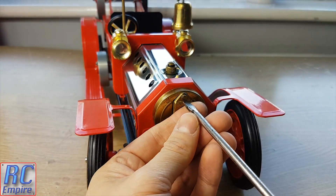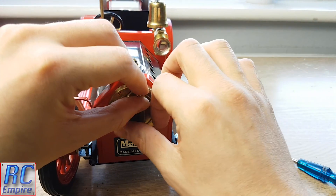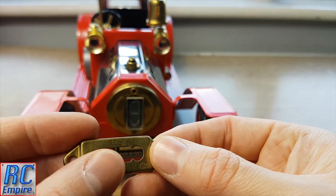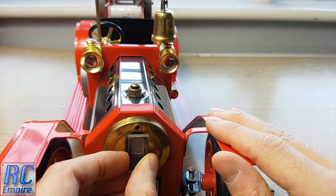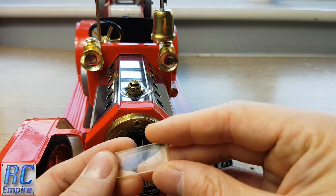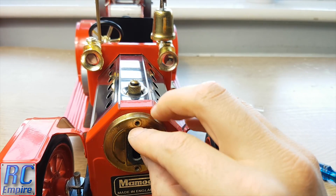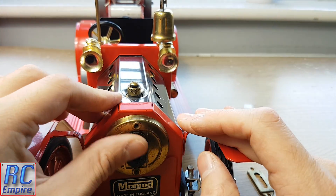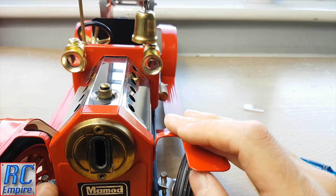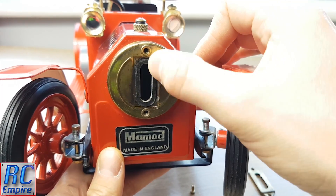To replace the glass, you first want to remove this cover. You can see that this is just a simple thin metal brass cap which holds the glass in place and presses it onto the rubber. With a little wiggle, you can pull the old glass off — do be careful just in case the glass is smashed and you could have little splinters. You can just see the little crack forming in the middle of the glass. Interestingly, the rubber on this doesn't seem too bad at all — it's still rubbery, not cracked or hard, so for this video we are not going to be changing it. If it does need changing, we will see in the next video when we fire the engine up — it might leak, or you will see steam escaping from the front cover. Really, the only place steam should safely be escaping from, if there is too much pressure in the boiler, is from the pressure release valve at the top of the tank.